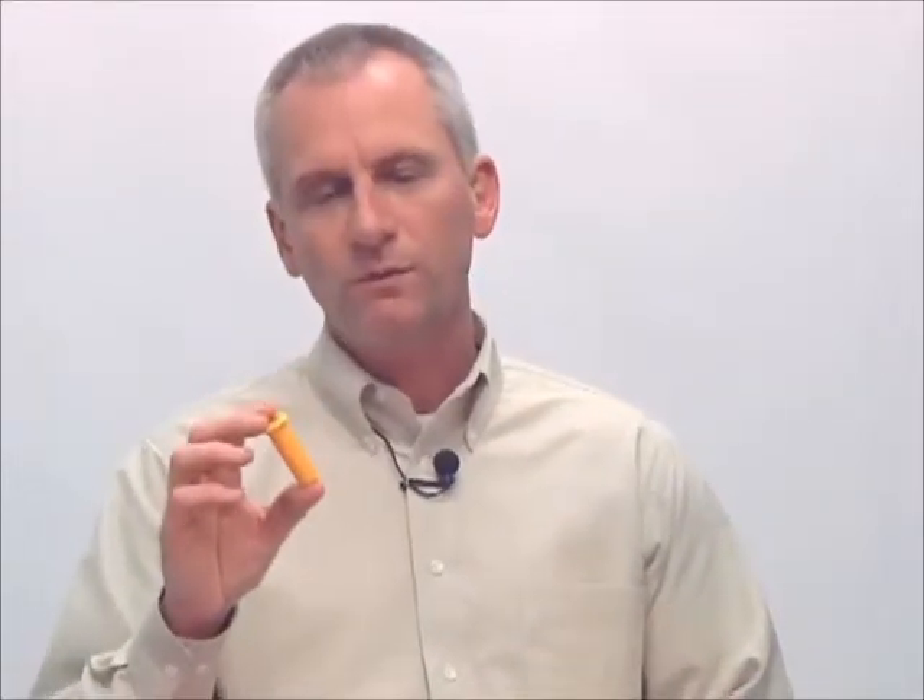Here's an example of a sleeve — there is no sensor in this. An external sensor of some type is used to actually read down into the environment created by the sleeve, and there are many different types. Here's another type of sleeve that goes down in the hole, and here's another form of sleeve. But they all are inserted into the hole, trying to create an environment for which an external probe reads the relative humidity.